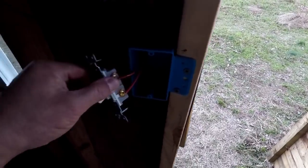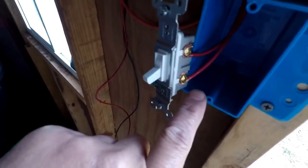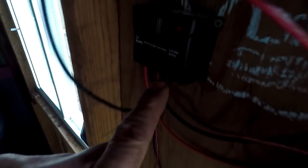There's a whole bunch of debate — can you use a 120 volt AC light switch? Yes, you can. You just have to hook it up correctly. I left a lot of this stuff undone just so I could show you what I did. You have your positive wire coming off of your load, which is going to be this LED light, and it's 12 volt. By the way, this is all 12 gauge wire. You go 12 volt, one side, to the switch. Then your other positive goes from the switch to the charge controller.